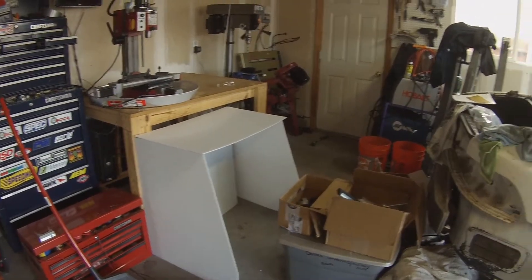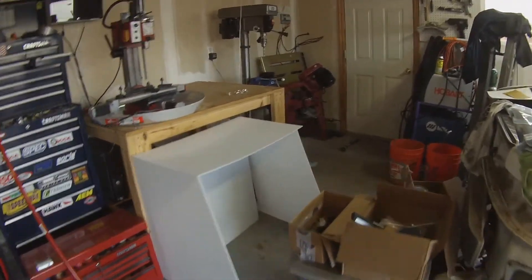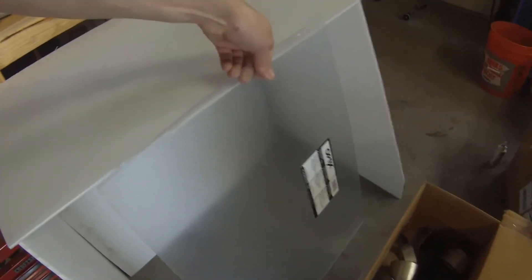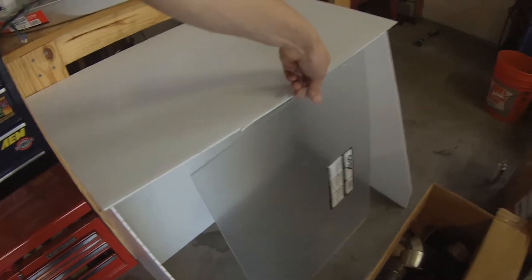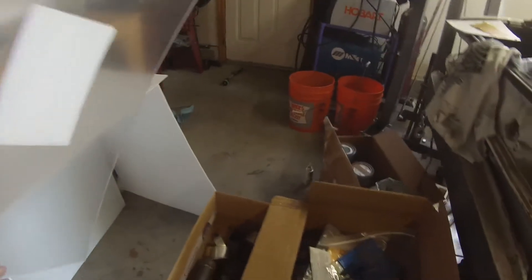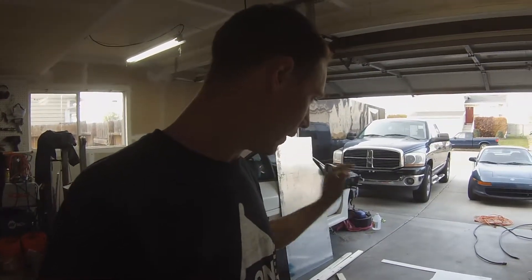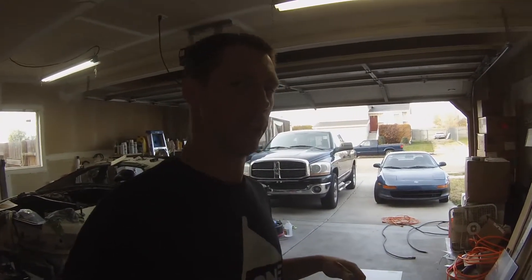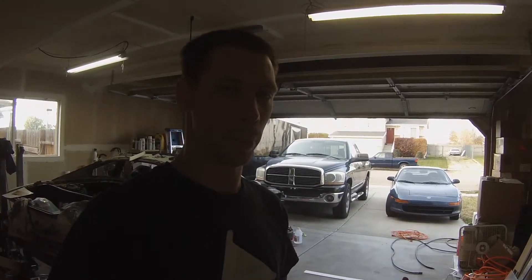So that's what we have so far — ta-da! What I'll do is tape that together and cut out a couple of front pieces for the bottom. This piece will sit vertically and it's going to be hinged at the top, so it'll flip up out of the way when I need to get in the machine. This should be a pretty cool, super low-budget project to keep all those chips from flying all over my garage.